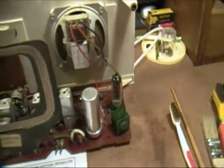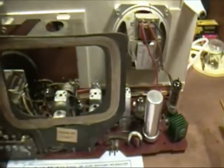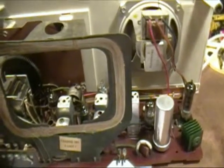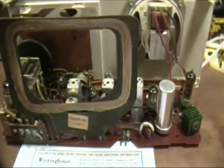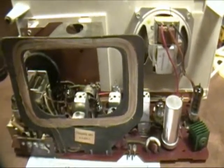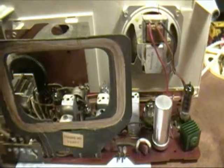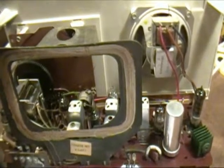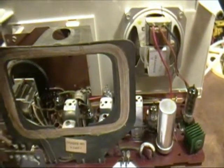We're back with the radio. I've dusted it off and wiped the tubes off with a soft cloth. Don't use any kind of solvent — not even water — to wash the tubes or you'll probably wash some of the lettering off. Some manufacturers use pretty permanent stuff; RCA generally works pretty well, but some don't. Westinghouse was notorious for having tubes where the markings would wipe off at the drop of a hat.